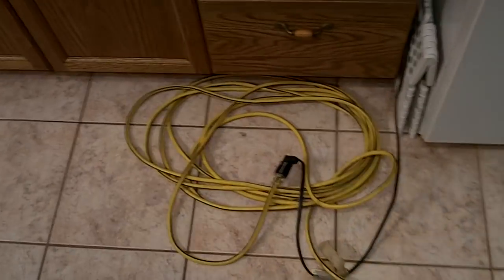I had to use an extension cord because only half my house is energized with power, because I am back feeding through the garage. It's fairly safe just because I have such a low power inverter, but that light switch doesn't work because that's on the other side of the breaker panel. Let's see if the washroom light works — oh yeah, so that all works.